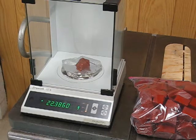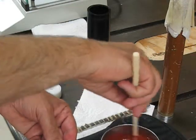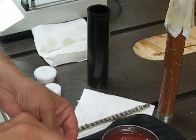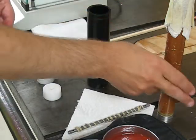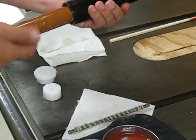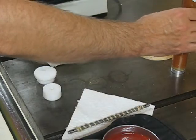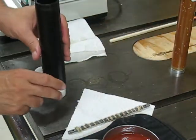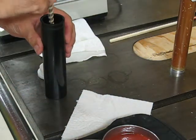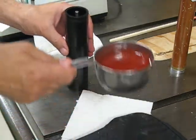I'll have to see how the casting goes with this fresh stuff instead. I'm getting ready to pour everything. I've got my melted composition in a cup here, and I've got to get all this done before it gets too thick. What I've got here is a smaller pipe with a paper towel on the end soaked in oil, so I'll pass it through my mold a couple of times just to make sure the inside of the mold is all oiled. Then I put on the small end cap, get the oil off my fingers, and put the center core in.